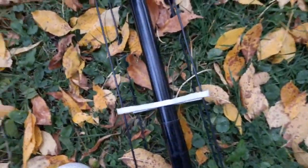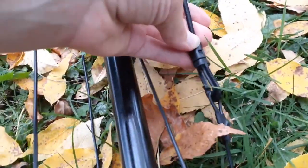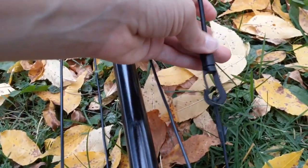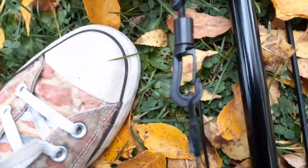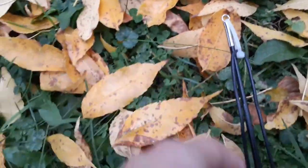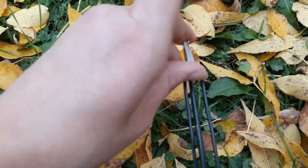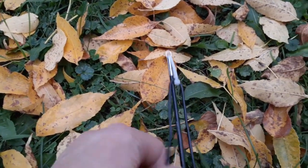Here you can see — I'm going to use the 15 meters for a bit of an example. You can see the element, which I folded over at the end and wrapped around with electrical tape. Then I have the bungee cord attached to the Jubilee clip — I'll explain how the Jubilee clips work in a minute. You want the elements to be tight enough that they're not flapping around, but not tight enough that you're bending the other half over. This is the 20 meters and the 15 meters, both attached to that plastic plate. The 40 meter goes all the way up to the top. I made a mistake with the 40 meters — I didn't do the top bit quite correctly, so I did just put a little bit of a zip tie there. Quick fix, it works, and it fits when you collapse the pole.